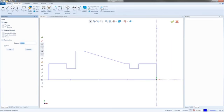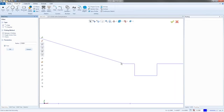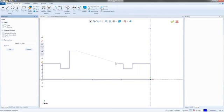So now for that fillet, I can come in and say create 2D fillet, and I'm just going to put in the radius of 2.5. And then this is what we got going on. So the function that I used is going to pretty well put the fillet where that sharp corner would have been made. And then we could just slap the radius on it. I don't remember what I put in for these small fillets. I don't see them. Oh, 50 or 500.